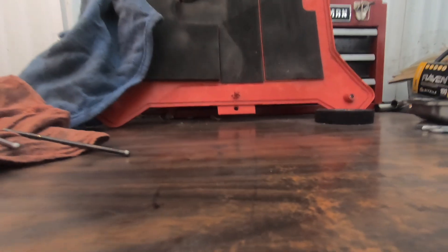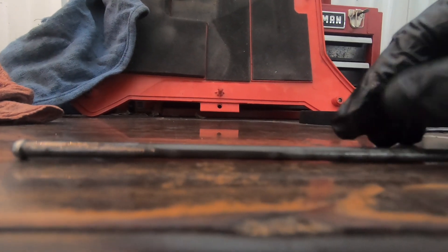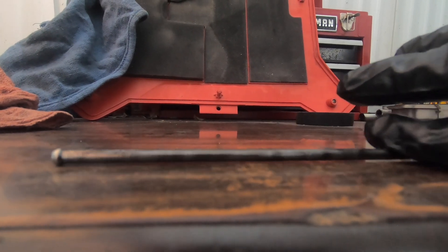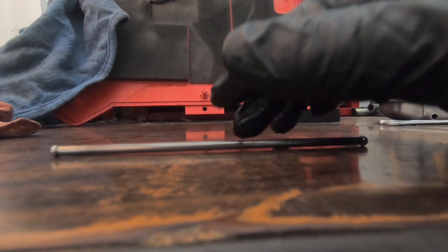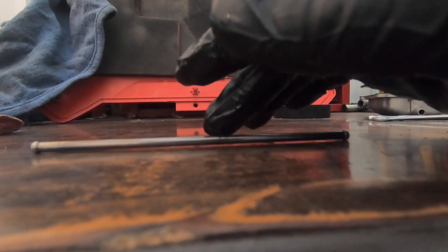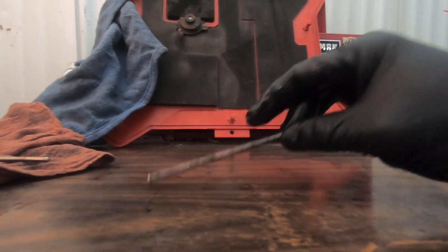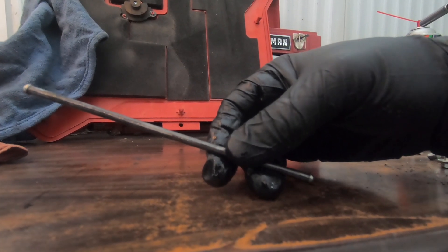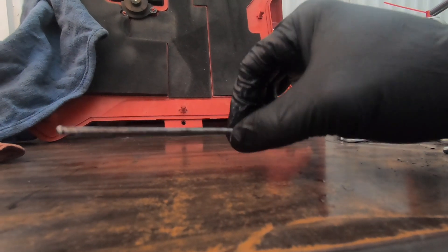The generator was running a little bit rough. Excuse me for the poor lighting, but check this out — I'm going to roll it slowly. You see that? Low, high, low, high, low — the push rods are bent. That happens when the valves are too tight from the factory. This is the exhaust one, and this one wasn't so bad, but the intake is pretty bad. I'm gonna try my best to straighten these out and reinstall them, then do a valve adjustment again.